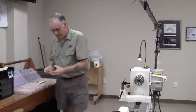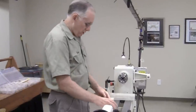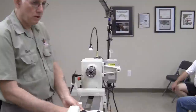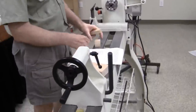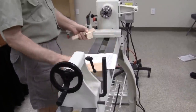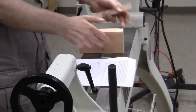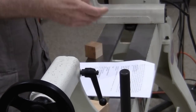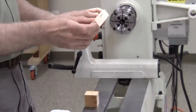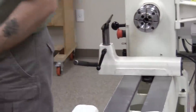I make a couple passes through the table saw: I set my fence to the thickness of the 2x4 and rip it down to come out with a square block — about an inch and a half square. Then I do the same on my radial arm saw or chop saw, set my stop block, and cut the pieces off. That's for the body. For the finial and icicle, same process but on a seven-eighths inch square stick, about six and a half inches long — and I get both the finial and icicle out of one block.